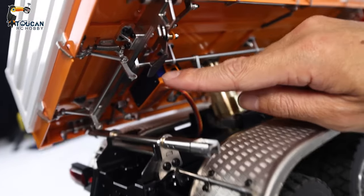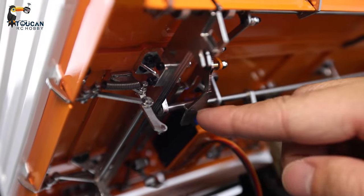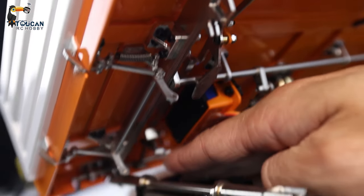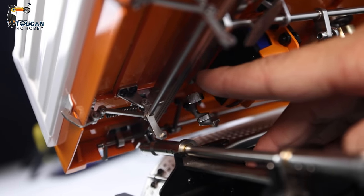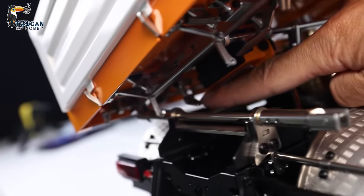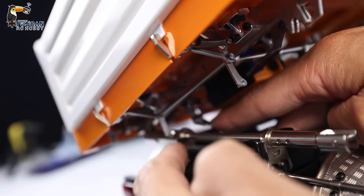What is important — you will see here when pulling, it's pulling to the right side. So this switch you see here, it's the bar on top — it is on top of this secure bar. That's the right position. But after rising the left side, this one is already dropped down, not locked by this bar on top. So when I drop it, sit back — you will see this one will be pushed by the chassis and pushed up. Then when moving the lock, the servo, the bar will be shifting, and this bar will be locked to the top again.